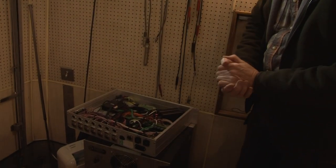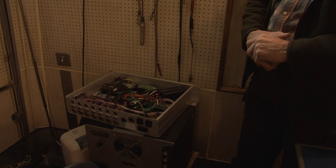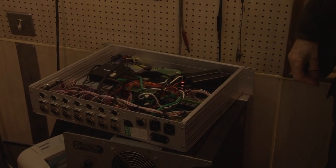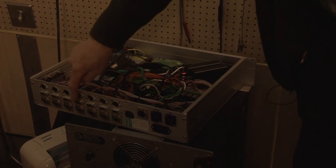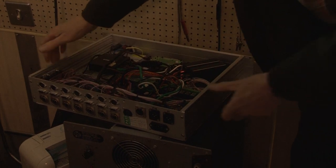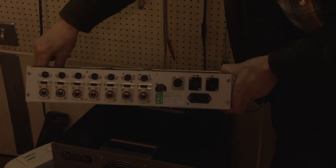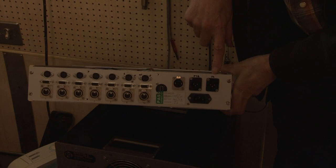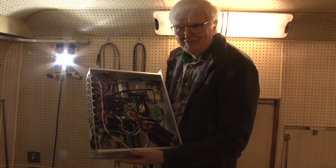We're going to have a quick look at the computer that runs the display. Here it is — the Raspberry Pi is in there. The software for that was designed by our volunteer Paul, and the case was wired up by another one of our volunteers, Ginge. At the back here are the outputs: the VGA connections to the monitors, and right at the bottom the XLR outputs with the 12 volts that run the monitors mentioned previously. There are also two sound outputs — one has production talkback PTB and the other has program sound PS. It's quite a modern item, really out of place in this truck.